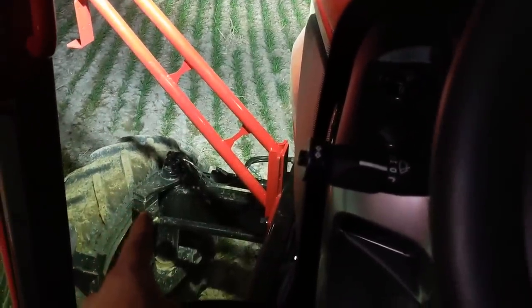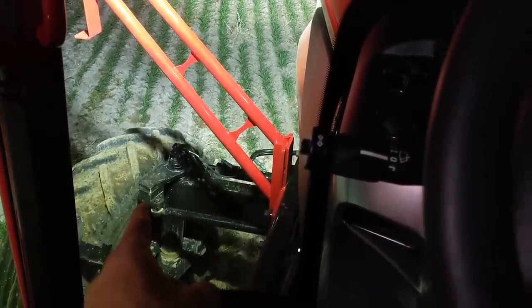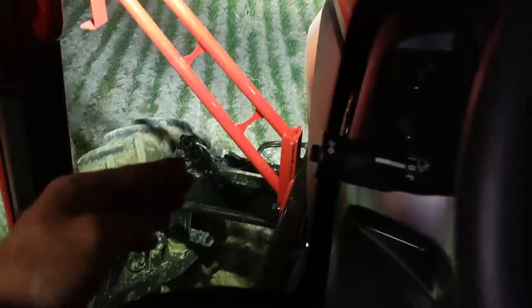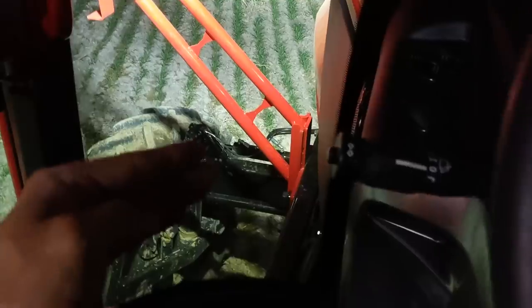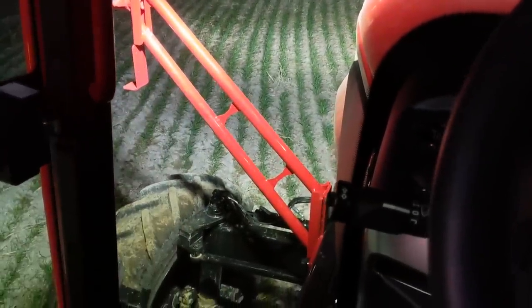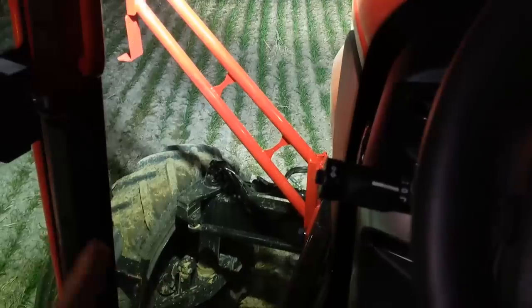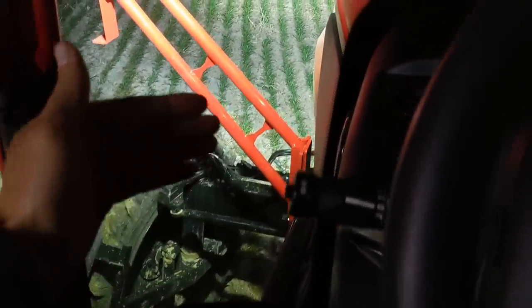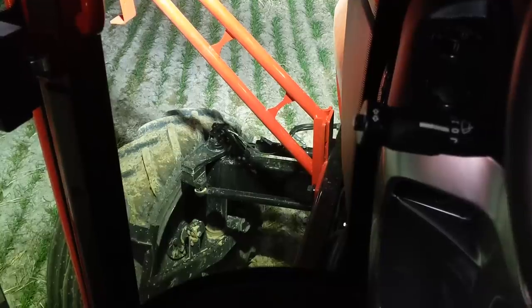Speaking of hills, I actually had to stop because this field is very difficult to do at night. I came out with a load, and being that this is two wheel drive - not a front wheel assist - and the tire's a little smaller, and it has a 70-30 weight displacement, 70 obviously being on the back, the wheels kind of like to skid a little bit. You gotta be careful how fast you turn - if you turn too fast, they wanna skid and then you start tearing up the crop. When I was going down the hill, turning wasn't really a problem - there was enough weight on the front end. But when I turned around going up the hill, there was hardly any weight on these wheels and they were just easily skidding trying to get turned on the side hills. That's one thing I noticed when I got in these hills with the full load on.